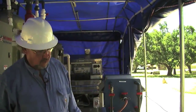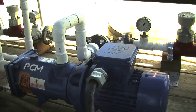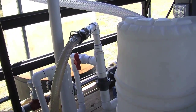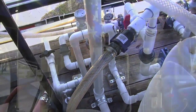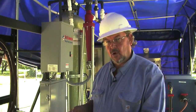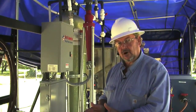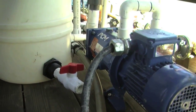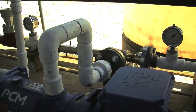From the bulk oil storage container, our next step is the de-oiling hydrocyclone. This device takes the water in tangentially running about 2,600 RPM. 96% of the flow goes out as heavy water, and the 4% going out the reverse direction takes all of the emulsion, oil, and particulate through the back channel in typical hydrocyclone action. The 96% of water coming out is at about 150 parts per million of FOGs, so the hydrocyclone drops that 10,000 parts per million oil down to 150 parts per million of free oils.